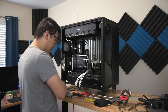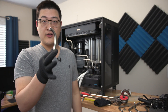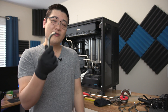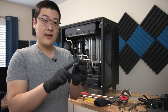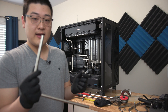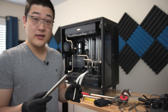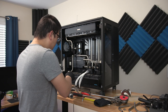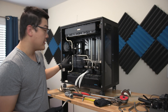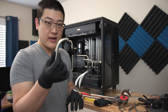So what I actually ended up doing was going on eBay and buying a bunch of stainless steel tubes from a random seller out of China. They took about a month to ship. What I bought was a bunch of 12mm tubes with one millimeter wall thickness, as well as some 12mm tubes with 0.5 millimeter wall thickness — we'll talk about the differences in a moment. I've done successful bends and been able to tube up several runs here, so I've got a pretty good feel for these metal tubes now.